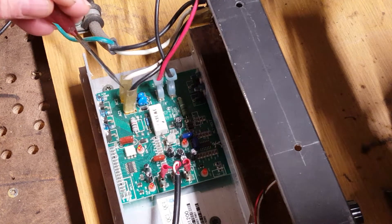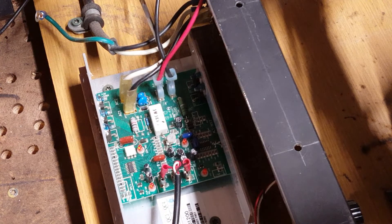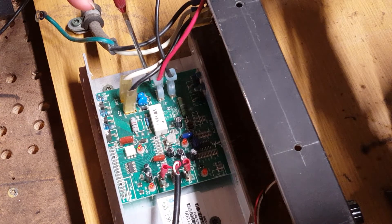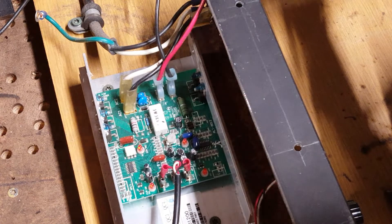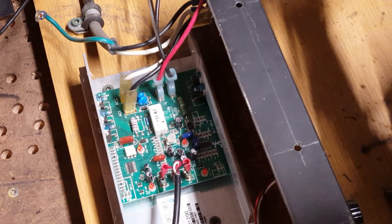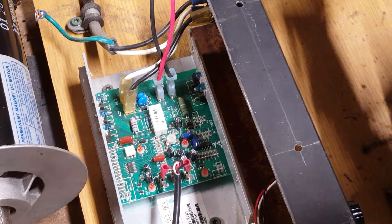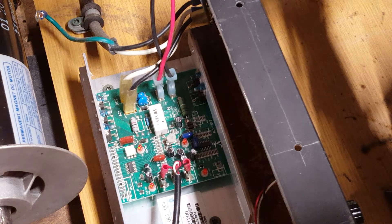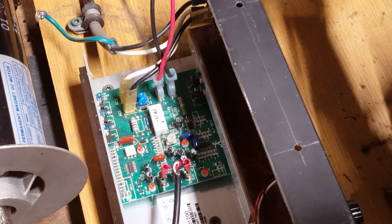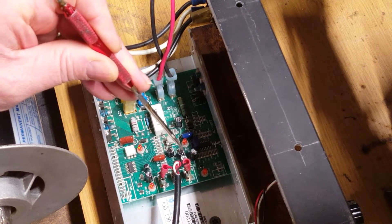In this particular instance they don't have that. Power comes in through the switch into the board. Power coming out: positive A-plus is red — it's got A-plus red written there — and A-minus black, going out to the motor. Theoretically if you reverse these you reverse the motor. I've just got a small junk DC motor in here just to show the wires. Power in, power through the switch, down to the board, thermal brake here if you want, and earth to the body.